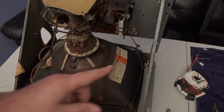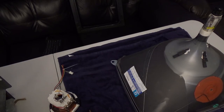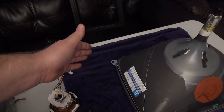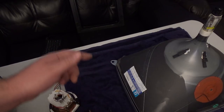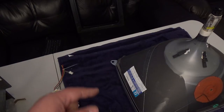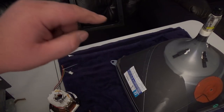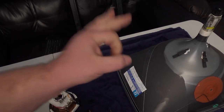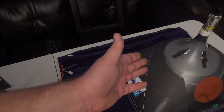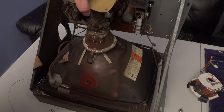This tube I got from the trash, and I haven't even plugged this TV in yet. Something to worry about when you get a TV from the trash: someone may have thrown it on the ground. There's a possibility the tube may work but will never converge properly, because inside the screen there's a metal screen behind the glass — like a screen door. If the tube was jolted too much, that metal screen that's supposed to be perfectly flat could have a warp in it, and it's nearly impossible to fix. So it's a gamble.